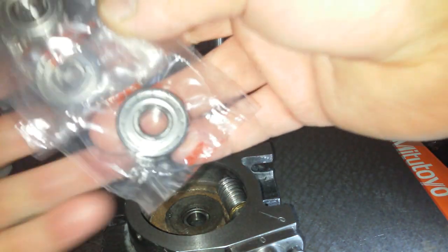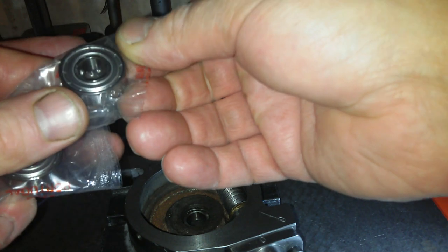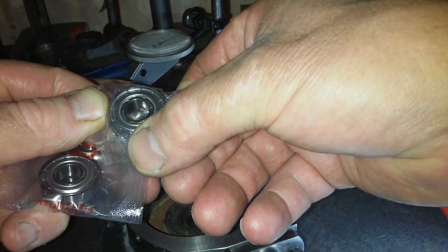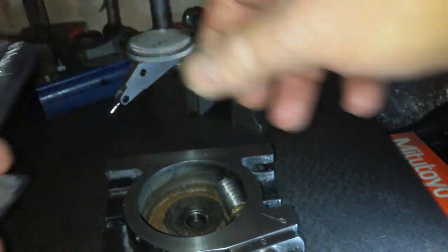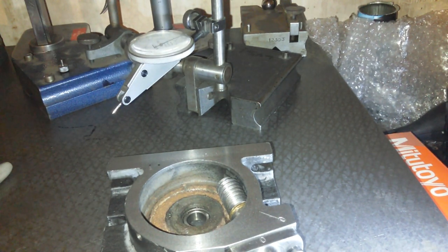Now these are not 6001Zs, these are 6000Zs, I believe. I can't quite read it in there. These are 6000C-2Zs. So these are smaller. Awesome. Can't use those, I'll have to order a new bearing, but